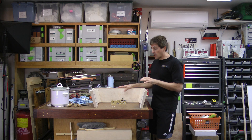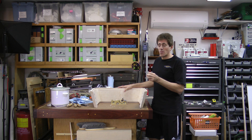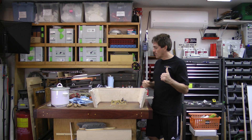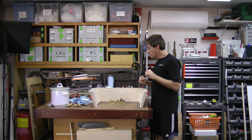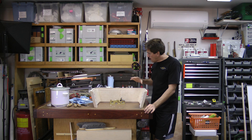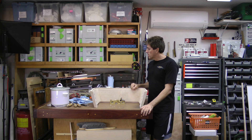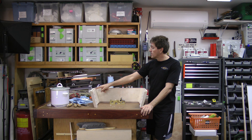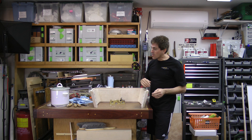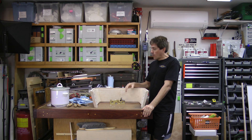I have all the rabbets cut on one of the cabinets. I decided not to do both at once — there's always a chance I'd realize something should be done differently, and doing one first means less rework on the second. I did trim this one with a shoulder plane to get everything much smoother on the edges. There were a couple of facets where I believe I had the angle incorrect — I may have swapped left and right parts in my stack — but when I go to set up for cutting those facets on the other cabinet, I'll recut these. The extra depth in the corner, I'll just call a glue recess and move on.